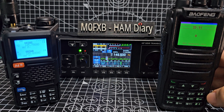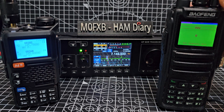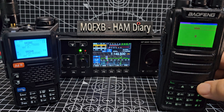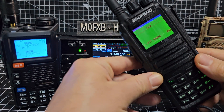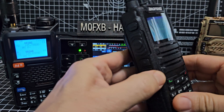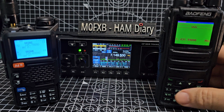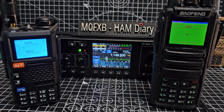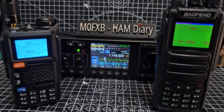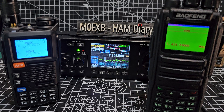Of course it's also just a normal DMR radio. You can manual dial — just press the hash key, dial 91, and you can now manually talk on talk group 91, and a lot more. Ultimately it's a dual band radio. It's taller than the RT or MD-380 type radios, with a nice big battery. It does not have USB charging but comes with a nice cradle charger. It has two buttons I like: volume and channel. You can use the up and down arrows, a full keypad, DTMF, talk group 91 — all the usual stuff. It holds the whole database; although advertised as holding 120,000 contacts, it will actually hold up to 300,000. The OpenGD77 team have worked so hard on this software and it does a lot more than what I've just talked about.